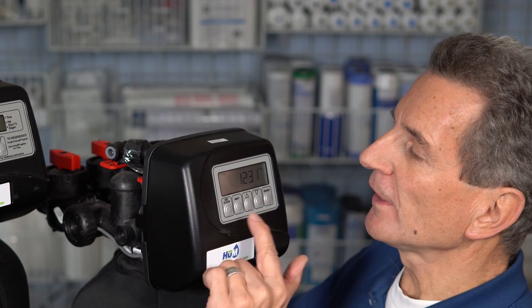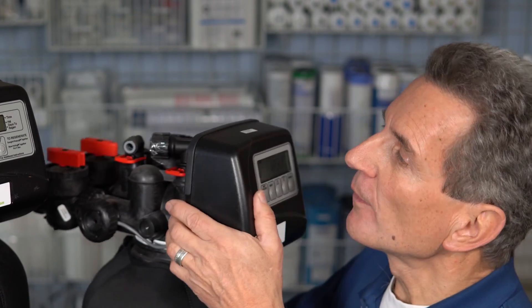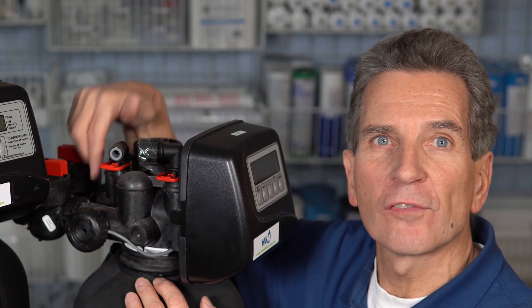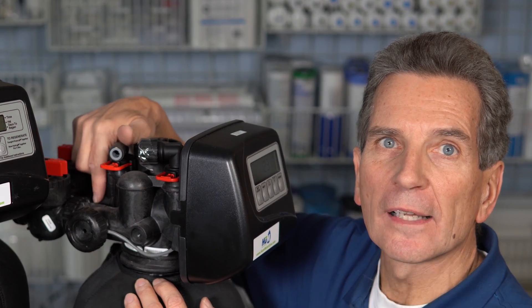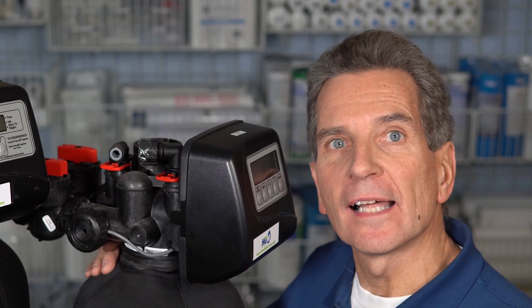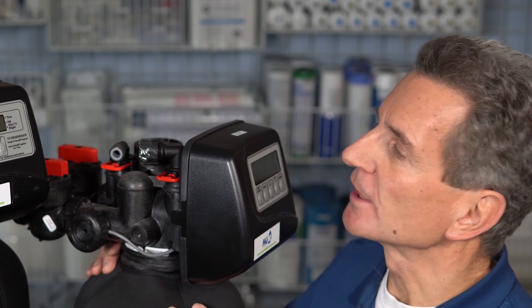If you have a five-button water softener, the meter on the CLACK ones is on the side — you can see a cable going back here. If you have a different brand, just look for the cable. Often it's in the back, like on a Water Boss or Aqua Master water softener. Fleck water softeners and many other brands also have the cable back there. I have a great video showing how to check that flow meter with a magnet — I'll put a link in the description and in the cards above.